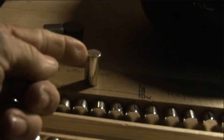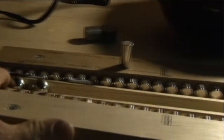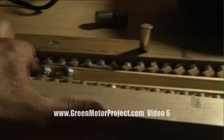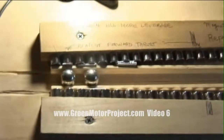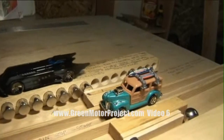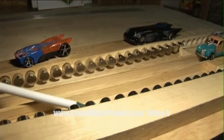The magnets we're using in these rails are 1.5 inch by 1 inch neodymium N42 magnets. There are 50 magnets in each one of these pieces of wood right here. The magnets are pulling on each other — they're attracting. They're all the same: these would all be north, these would all be south faces.